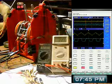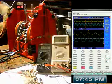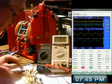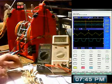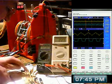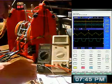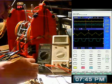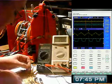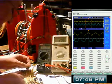Well, speed's gone back up again since I took the capacitor out, so maybe what we need is to advance the signal a little bit. So I'm going to stick the 100N across this, let's see. Yeah, I think what I did yesterday was add a 100N between the input, the trimmer pot, and the pin 3. Let's see if that advances it. Let's see if that actually increases the speed.